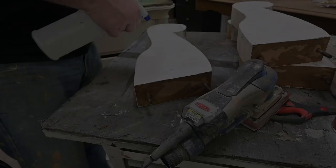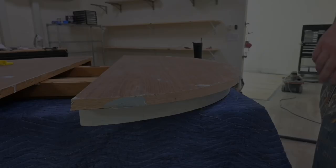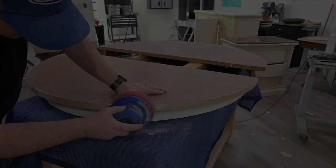We're going to take care of the base now — starting by cleaning it and getting all the grime off, then giving it a really good sanding. We're not going to worry as much about sanding every little bit. There was one small spot on the edge trim that didn't go very well, so I put a little Bondo on it. For the most part the edge banding made a major difference. We've got it all sanded down and we're moving into priming with a black primer, which is absolutely a major change to this piece.